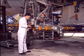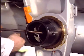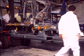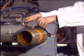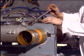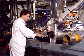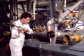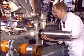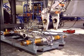Fit the thread protector onto the bogey beam hinge pin. Support the bogey beam in the cradle using a forklift truck and secure the bogey beam. Drive out the bogey beam hinge pin using the appropriate tool, taking all precautions to avoid damage to the bushes, shock strut, and bogey beam. Lower the bogey beam using the forklift truck and move it to a safe area.